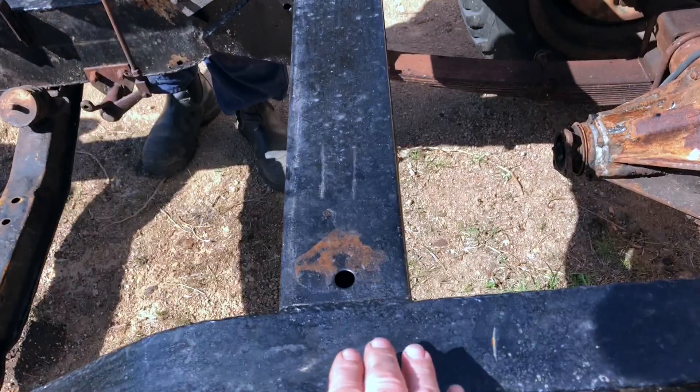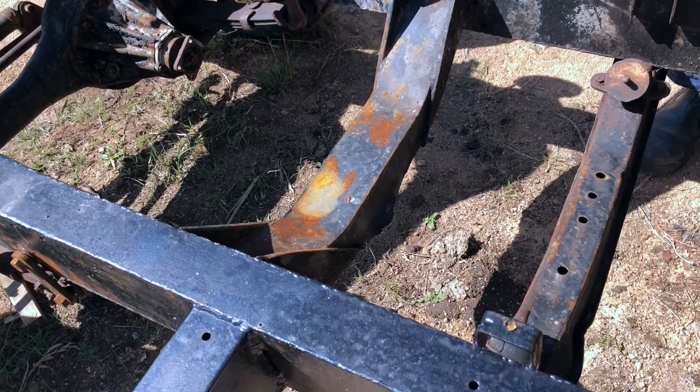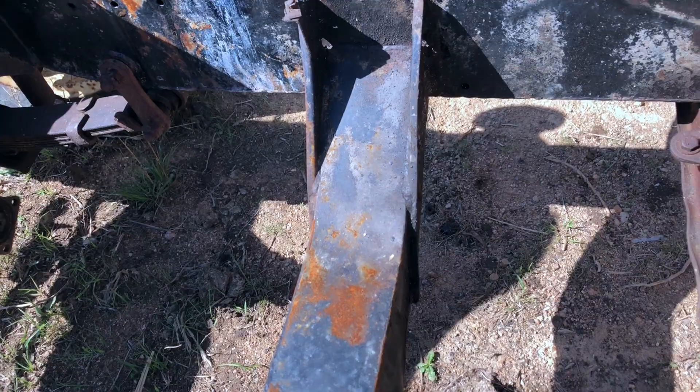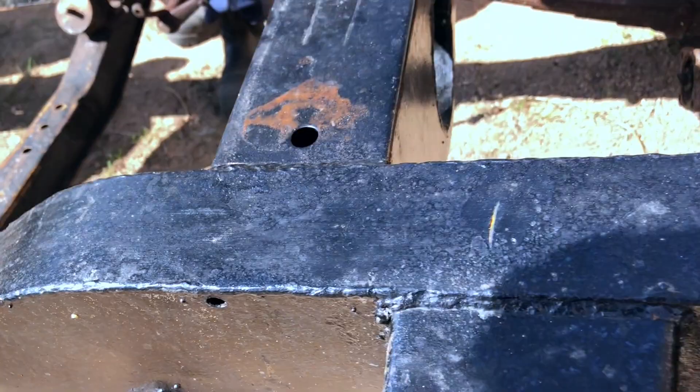It's interesting to note here where we've put tannic acid on the surface — it's a nice dark surface. And in this area here where we didn't put tannic, because we've got to do a little bit of work a bit later, you can see the flash rusting there — the surface corrosion that's occurred because we've had about an inch of rain in the last couple of weeks. So it shows the effectiveness of the tannic acid.